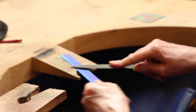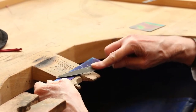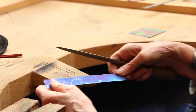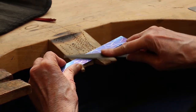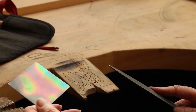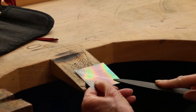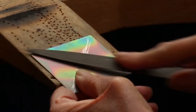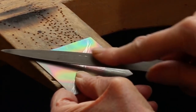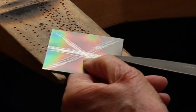What you do is take off the oxide layer so that when you heat it the next time, these pieces will colour at a different rate. Make it as random as you can. This is the heat coloured piece with the multi-colours. The principle is just taking off the oxide layer, or most of it, so that it will colour again from the beginning and go through the same colour range.